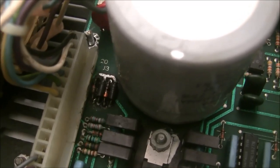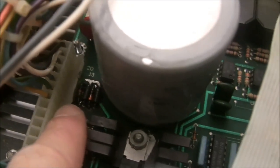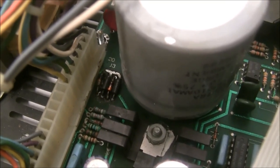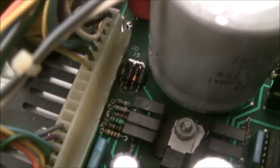Starting at the beginning with the power supply: it should be able to at least power up and get the 15 volt rail stable. But I noticed the bridge diodes look a little crispy, and someone replaced the 1N4000 series bridge diodes with 1N4148s — those orange diodes in the first and third positions. Those are small signal diodes, not power diodes, and are not acceptable for use in bridge rectifiers.